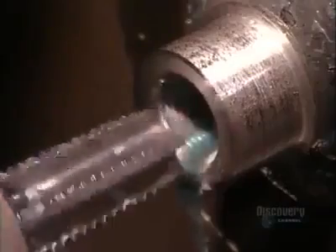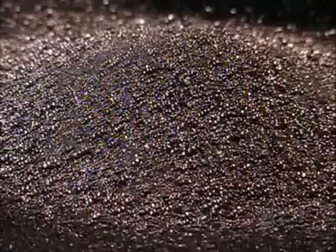A cutting tool carves open the neck and cuts threads inside it, providing the best seal when the valve screws into the neck. Workers clean the cylinder surface using a process called shot blasting, where a machine shoots tiny steel pellets at the cylinders at very high speed.